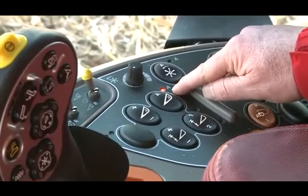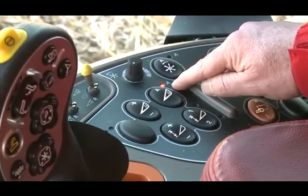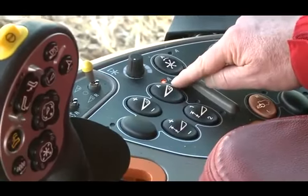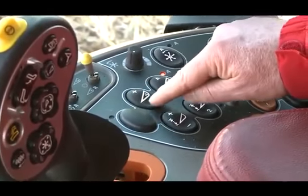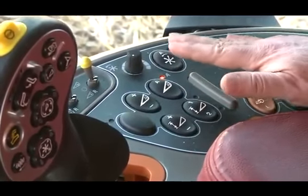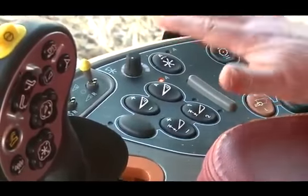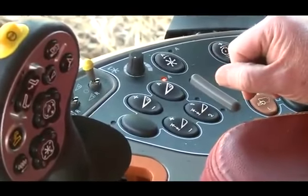Now as I speed up and slow down the combine, we will speed up and slow down the feeder based on our toolbox feeder miles per hour, which sets where our minimum feeder speed and maximum feeder speed will be. We can also use the manual feeder speed adjust when in automatic mode to set an offset — making the header go faster at all ground speeds using the plus, or slower using the minus. I use the display to set the ratio, then fine tune with the manual feeder speed adjust to match exactly to conditions like stalk height and picking height.